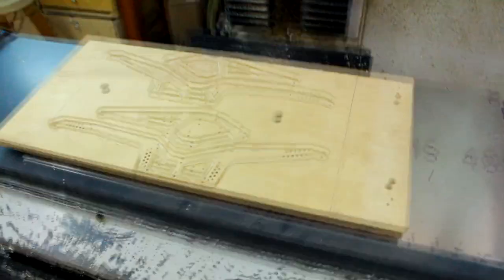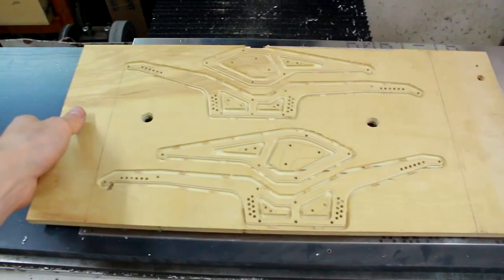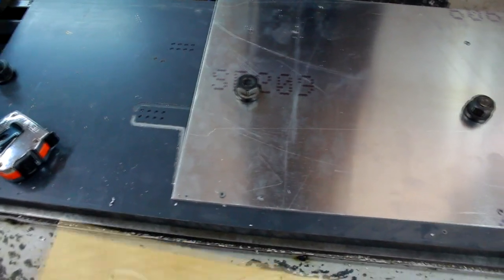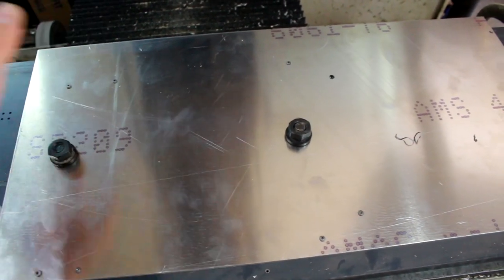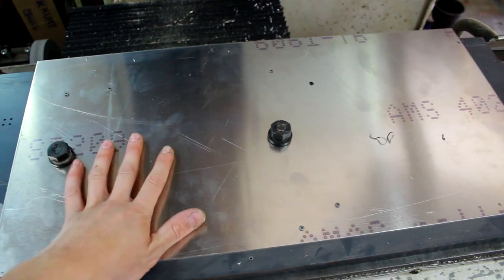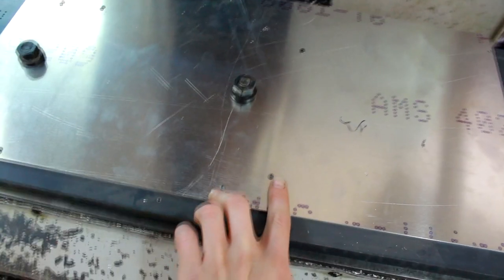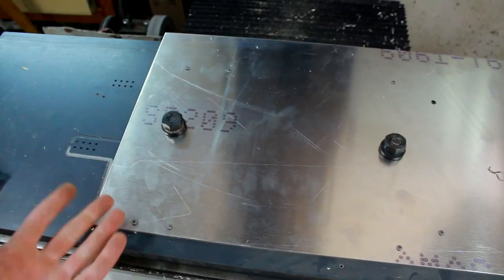Right, I decided to use the big piece of plastic. I actually came up with a, I think, pretty good setup. Come take a look. This piece of wood here was my test. Got two holes drilled in it because I put bolts and T-nuts through the big sheet of plastic, holding the aluminum down, which bridges the gap between using fixturing blocks with T-nuts and bolts and screws. It bridges that gap because I've still got two screws in each corner just to keep the corner chatter down, because from here to here it's a lot of flex.